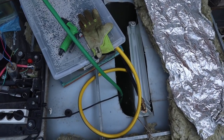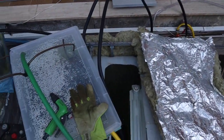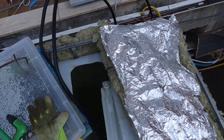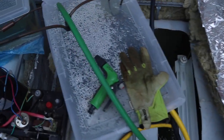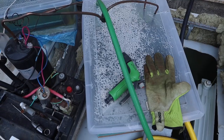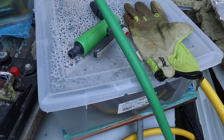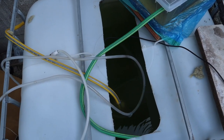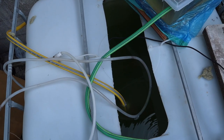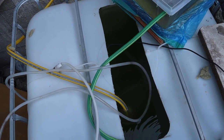Another part of the experiment was, of course, to insulate this big tank. I did it with rock wool — you can do it in many ways, but you must be sure that it will not get wet. And also this water box where the heat exchanger of the heat pump is — this is the condenser which is inside — and then you have this tank, which is the cold tank from where the heat pump is taking the heat. So this is really part of the storage circuit, meaning you have 2,000 liters of storage instead of only 1,000 liters.